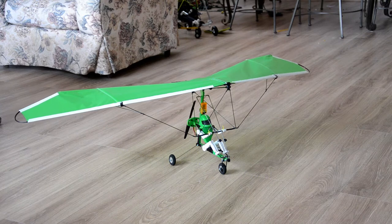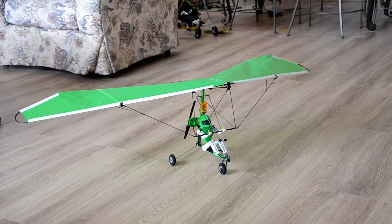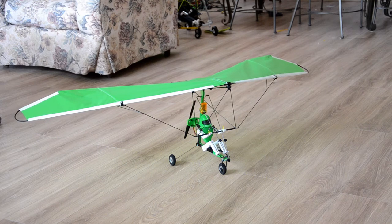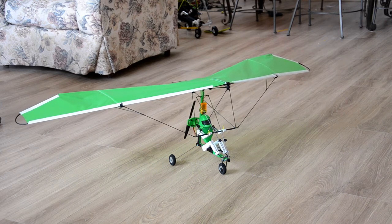It's manufactured from CNC machined fiberglass plate, arms, legs, and torso, which holds the servos, which operate in a mixed configuration of the control bar to effect up, down, left, and right control. True weight shift, just like a real pilot controls a Microlight, this mechanical robotic pilot controls the trike in the same fashion.